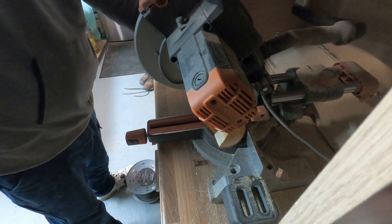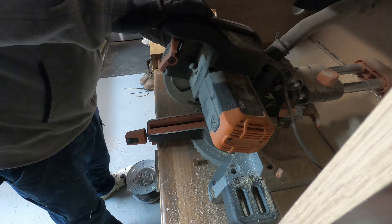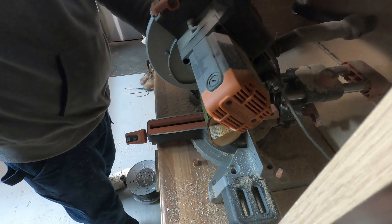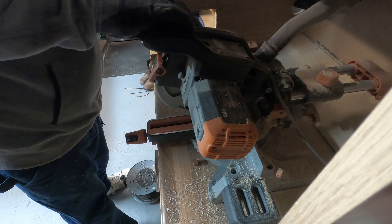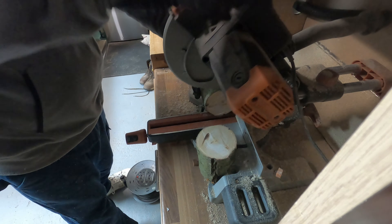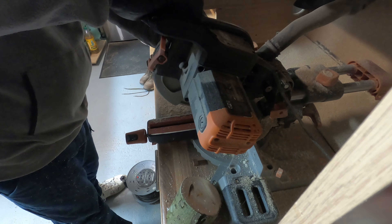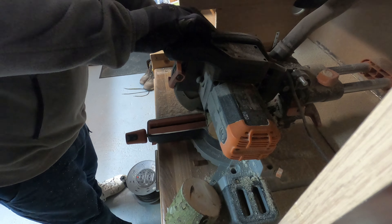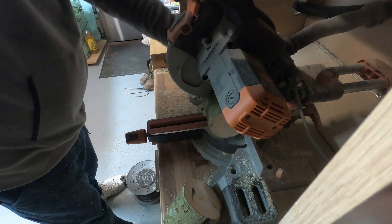The first thing I did was cut the log down on the mitre saw, and I was incredibly careful — one sort of kickback and you could be in a lot of pain. My hand was a lot closer to the blade than I would have liked, so I just took my time. I rotated it bit by bit, which gave me a slight angle, but the key bit was just getting it to a manageable size to go under the bandsaw. Apologies for the voice — raging with a terrible cold at the moment. Occupational hazard.